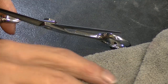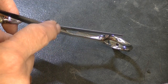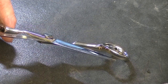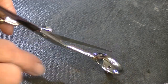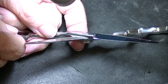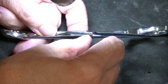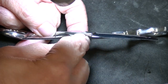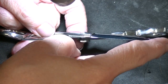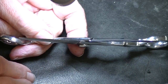When I turn this shear this way, you can see the angle looks consistent all the way down as a convex edge. But when I turn it the other way, you can see it: there's a flat area and then it's sharp. This was blunt at 5 degrees up to about this point, and then sharp above that. So we'll try to fix that today.